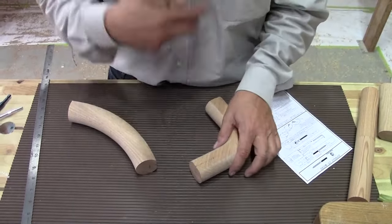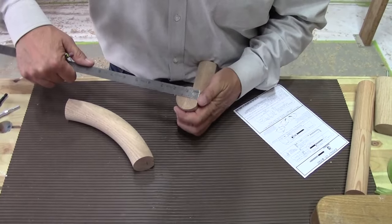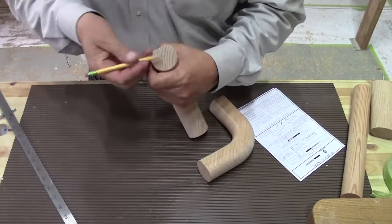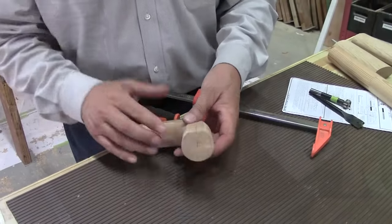What we're going to do is put two fittings together. I'm going to mark an inch and a half down onto the bottom of the rail for the center of the three-quarter hole, and nine-sixteenths up for the center of the bolt on the other fitting. Be sure those center marks are correct so you'll have ease of cleanup later on.